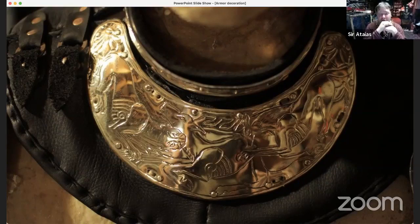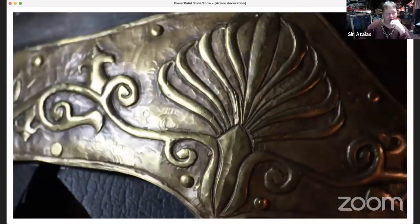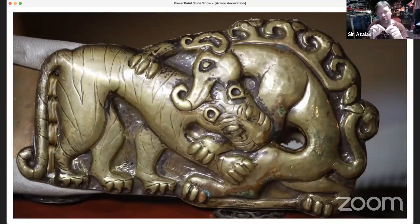As far as decorating metals is concerned, amongst the simplest techniques you can use is piercing, really dirt simple and easy. Another one is chasing. With those tools you're putting in just a little bit more investment. Repoussé gets more expensive, because now you're putting stuff into pitch, and you're getting a better variety of chasing tools and repoussé tools, so you can make all those shapes which you can't do with just a little liner tool. If you want to actually push metal around, you're going to have to spend a little bit of money and start investing in some tools, or make your own. There are tutorials for that out there.